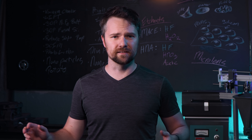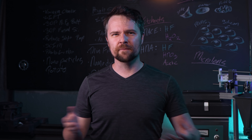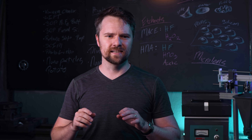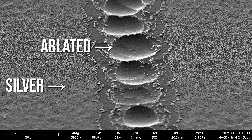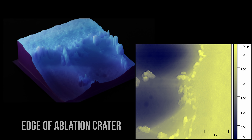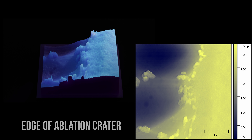I was attempting to get this technique to work, and as of yet, completely failed. I wasn't sure if etching was happening or not, if it was just really slow, so I deposited a thin layer of silver on my silicon wafer and then ablated away a stripe of the silver using my laser. The idea was that the spot under the laser would be free of silver, and everything else would still have it, so you should see some differential effect as it sinks. I didn't see that at all — in fact, I saw the opposite. When you look at the scans, the ablated region has smoothed out really nicely, making a really smooth, dimpled crater.